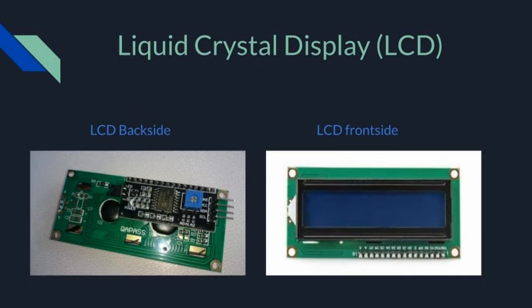The LCD module was relatively simple. The LCD has I2C communication capabilities, so only 4 pins were needed from the Arduino. In the Arduino code, I was able to print messages and variables onto the screen using commands designed for the LCD. During normal robot operation, the LCD would display distance traveled on the top line and the colored block to be found on the bottom line. When the battery was low, the LCD would say low battery, and when the robot was charging, the LCD would say charging.